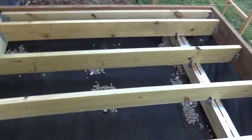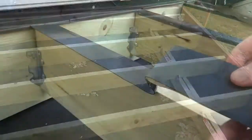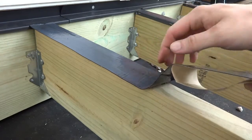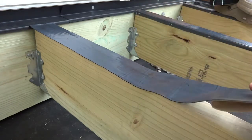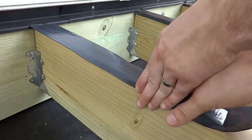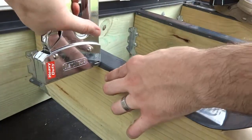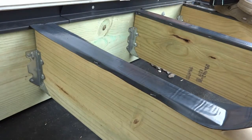So I'll slip it down and cover all these joists before I start doing the decking. I got that flashing cut down to about two and a half inches wide and I actually like it a lot better than that window and door butyl tape — it's more rubbery, thicker, and just seems a lot better. Real simple: just center it over the board, smooth it down, roll over the edges, and then go through about every six inches putting a staple just to make sure it stays in place. Do it on both sides and it's done.